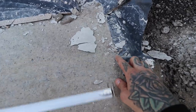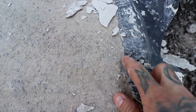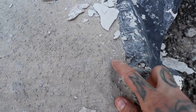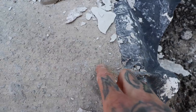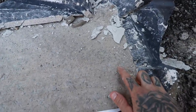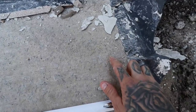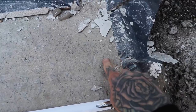Basically my battens are, oh dear, it just moved. Nah, it doesn't matter because I've got my mark there, as you can see. My battens are 28mm, which is about here, and then my OSB board is 18mm, which is about here, and then my 4x2 will be like 100mm deep or whatever. All I'm working out right now is the length of the wall down this side, so I can begin to build one of the walls on the ground. I've figured out my depth, so now I'm going to get a measurement all the way down there, and then we're done.